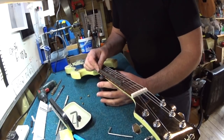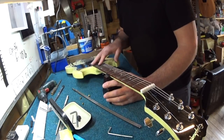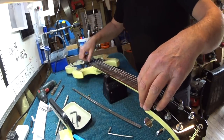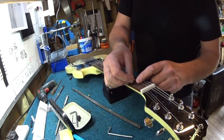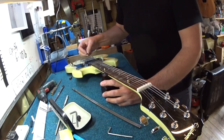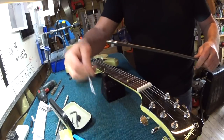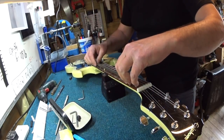Now I'm just going to have a quick diagnostic peek. What I'm seeing is some cutting up here where I kind of expected to find some, but none in the middle. So I think we probably need to recalibrate that and add a tiny bit of curvature to it, because it's very close. It's just fractionally not following the curve precisely. So if you ever get that cutting pattern, now I can see that it needs a little bit more bend. If you ever get that cutting pattern, stop and recalibrate if you're using this method. It's very easy to do.